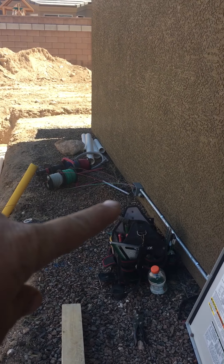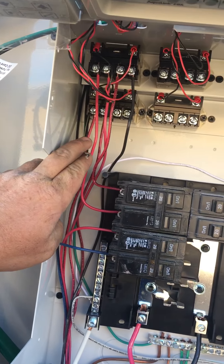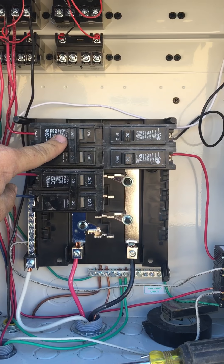On your relays, if you look, it says 2, 4, 6, 8 — 2, 4, 6, 8. Power 2 is power in, 4 is power out, 6 is power in, 8 is power out. I'm showing you that because this is 220 — so this is for your filter pump. Power goes in, power goes in on these. This one right here is power out, power out, power out.